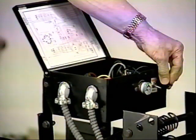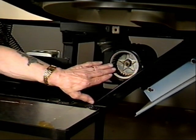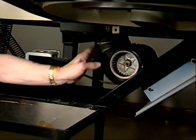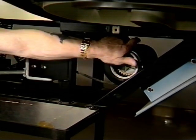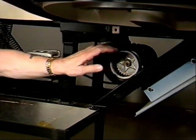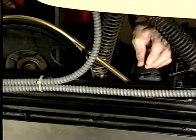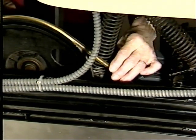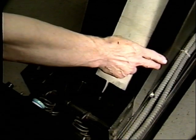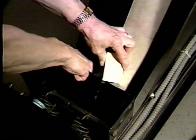The small fuse on the end is for the hand dryer. Maintenance on the Sure-Pick return would include the hand dryer — that includes cleaning the vanes in the blower as well as the air duct tubes that carry the air up. The motors used on this hand dryer have oil cups that require lubrication to extend motor life. The drive motor also has lubrication cups at each end of the rotor shaft. As part of our visual inspection we'd be looking at the drive belt as well as the lift belt itself. Visual inspection would include the ball guides as well as the leather belt, and as a point of maintenance we should lubricate between the pressure plate and the leather belt with soap.